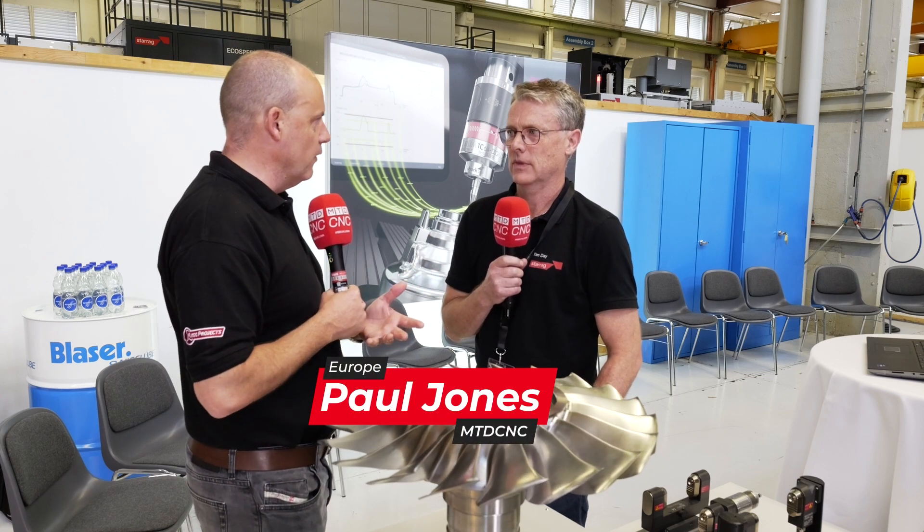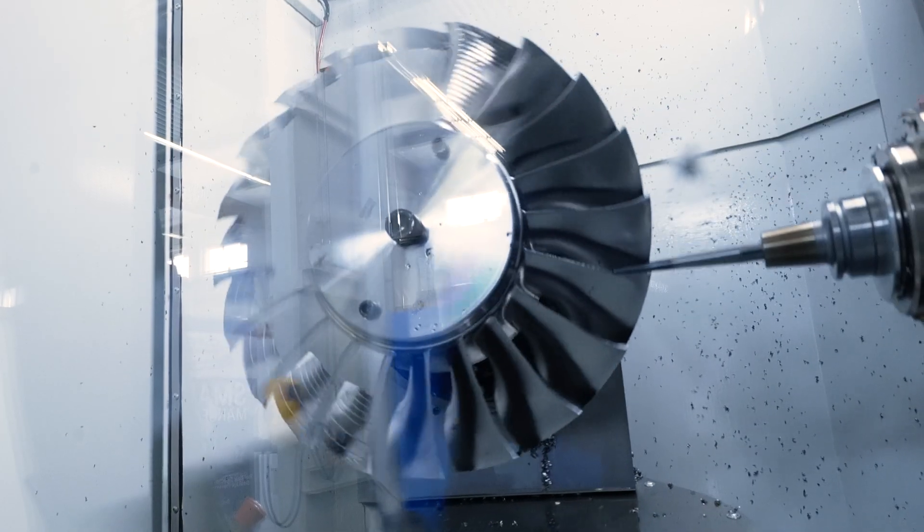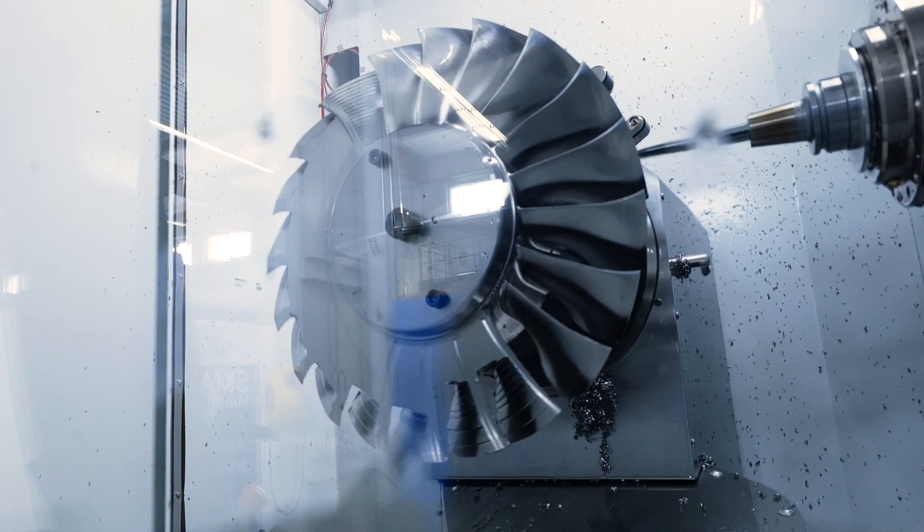So you're machining — there's a lot of metal removal in these, isn't there? Absolutely. And what's the crucial element, what are the dangers in making parts like these? Traditionally we could have used a precision ball end mill process to rough and finish, but the process time for that is too high. So typically now we try and rough with as large and the most efficient process as we can, which leaves a freestanding roughed aerofoil that has a lot more dynamic problems. We have chatter issues, frequencies, and that's the challenge of the finishing part of the process — to machine that freestanding blade.